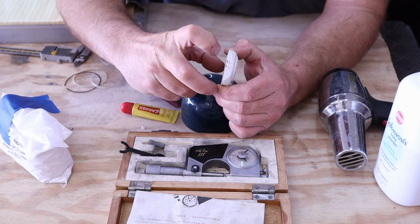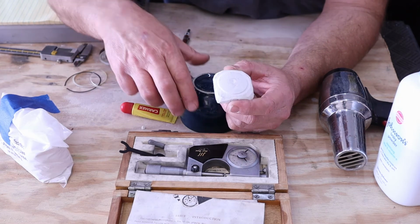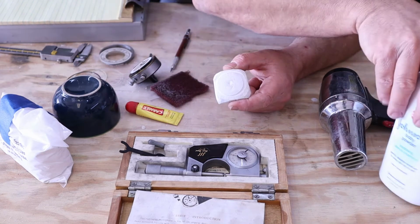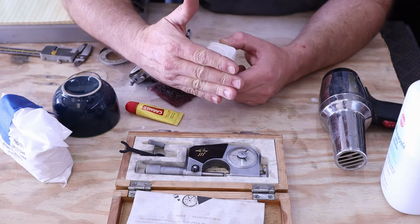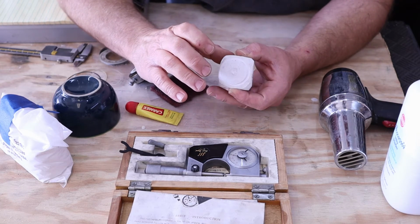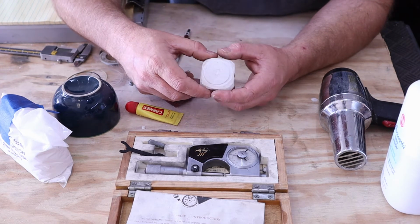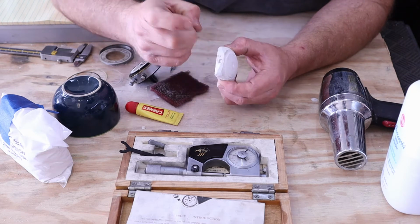That way I can firmly grip the steel backing and move it around and still have ample force. The other part would be, instead of using a random kitchen appliance, to go ahead and coat this with another layer of the release or lubricant or even baby powder, and then create a secondary mold, or the other half of this, so that when they're pressed together you have a true mold and a true fixed position where they both come together, almost as if you were casting metal, or creating a plaster cast where you can have that material cast. And I think it's important to have a good solid block to grip and keep in the lathe without running the risk of cracking your existing mold.